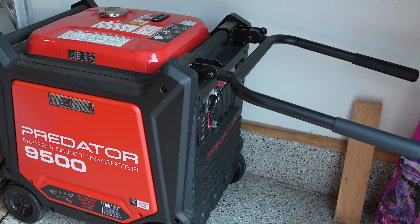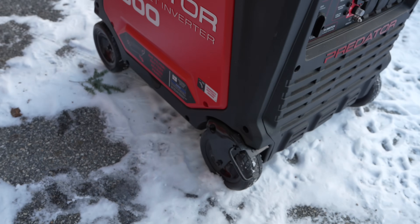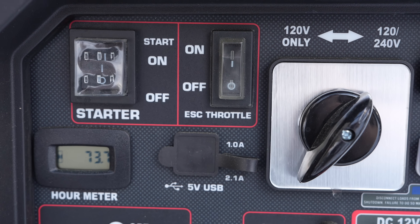It all begins with the power going out. The first thing you'll want to do is to get your generator outside. Don't go down to your panel yet in your house. Begin by starting your generator up. This brings us to the first big mistake. If your generator has a switch like this — something that says eco mode, any sort of a slow speed mode — you want to make sure that that is switched off. That's because most of these small engines do need to be started at full speed. If you put that eco mode on, you're going to make that engine bog down and struggle.